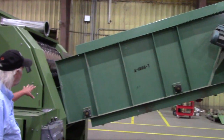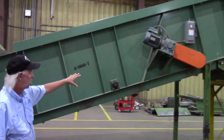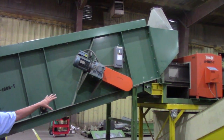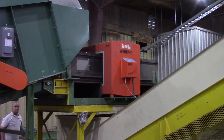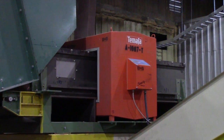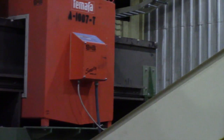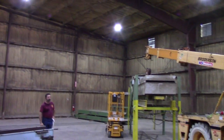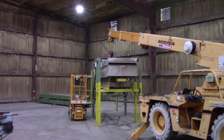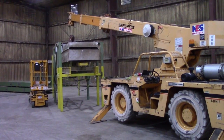Now what goes next? Once we leave the second structural breaker, any remaining fiber and core is transported up through this incline conveyor. It then goes through a metal detection process — this is a rare earth magnet, very powerful, that will catch any ferrous or non-ferrous metal that may be in the raw kenaf or raw hemp. Now we're making the turn like we saw in the blueprint. And this is the beginning of the turn. That over there with the crane is a shaker table. We're fixing to position it where it belongs. It's a screening process to screen out any short fiber from the core. Then it comes back as we saw in the blueprint.